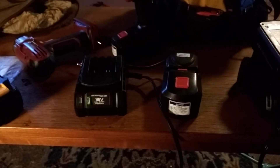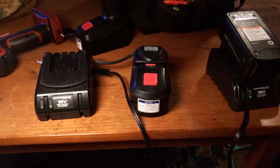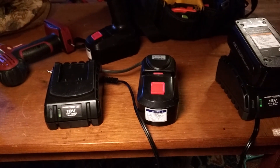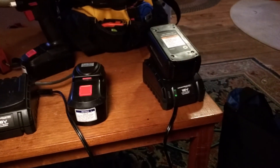You can hook both up at the same time, but I don't recommend it, because you've basically put both battery packs in series and the charger won't know which one finishes first — the one that gets done first is probably going to get overcharged. I would recommend this modification to anybody who's comfortable with electronics and not too worried about setting things on fire. You will need one fast charger, one slow charger, some wires, and a switch if you want to toggle between modes — otherwise just wire it straight. You'll be able to charge the cheaper batteries just like with the fast charger.